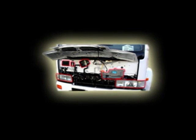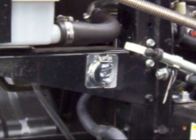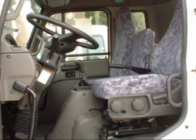Below the windshield is the front cab panel. This panel was designed so that the operator and service advisors can easily check the cabin heater air intake filter, air conditioner charge connection for the refrigerant, heater core, wiper arms, wiper motor, and engine coolant reservoir without tilting the cab. You may also find the optional engine block heater port — in cold weather, simply plug into a 110-volt outlet for carefree starting in extreme cold conditions.